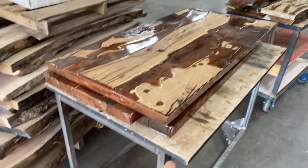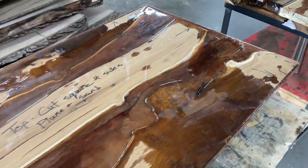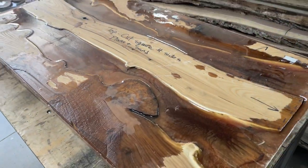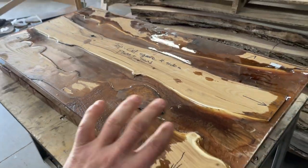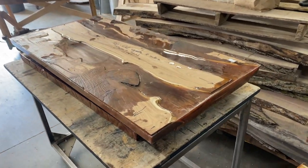This is what we've ended up with — one, two, three coffee table size pieces. This is very common work that we do. We're going to be surfacing this. It's going to come out of the wide belt sander, sanded to 120 grit. We've got to use our judgment on low spots, high spots, how much it takes — usually just maximum thickness, use your discretion.